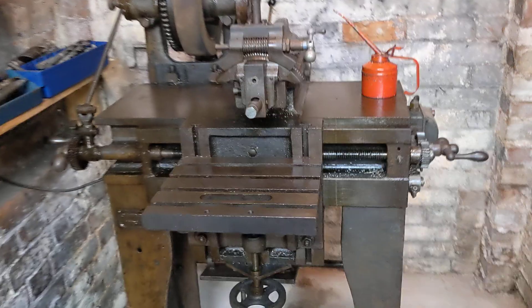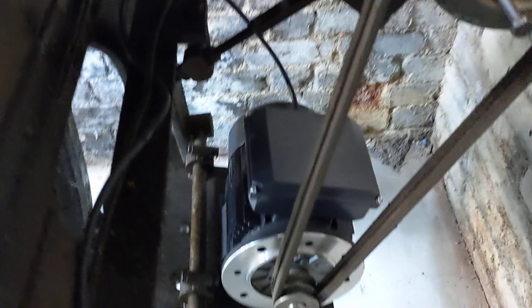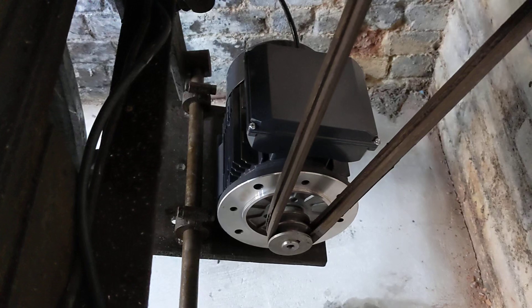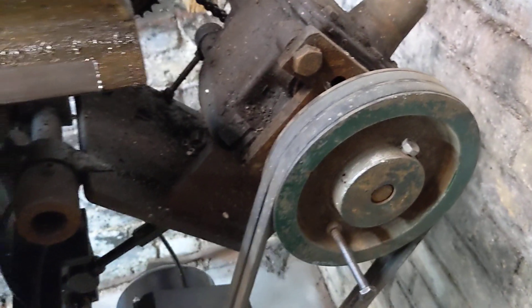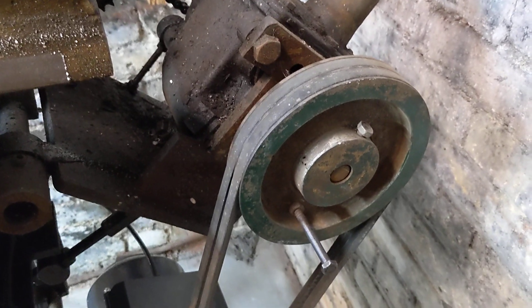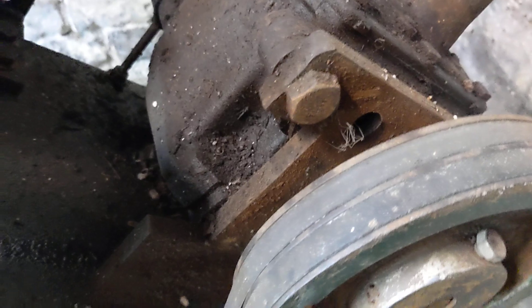There's been a fair bit of time spent oiling everything up, getting things unstuck and unseized — the sliding jib, all the bearings — and putting some fresh grease in. Of course the biggest job was fitting that new motor down there. It's one and a half kilowatts, a two horsepower motor, because there's quite a bit of starting torque required to get the whole thing operating. I've managed to get two belts on where it had a single belt before, although they're old belts that have just been lying around, so it'll probably benefit from a couple of new belts — maybe bought with some Christmas money.